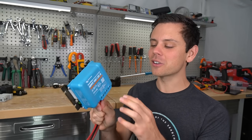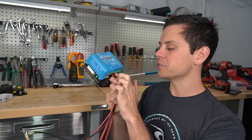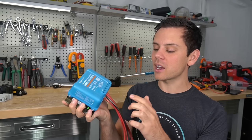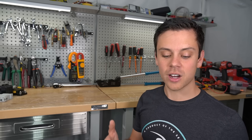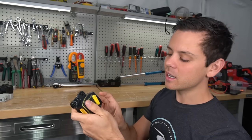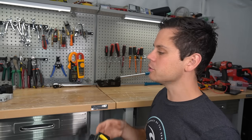This is especially important with any device that has to sense voltage from your batteries — an undersized cable will throw off the voltage readings and it will not work properly. For example, with the solar charge controller, use the largest size copper that will fit safely in that terminal and keep the cables as short as possible. For an LF inverter running inductive loads such as large motors, it is preferred to have the largest cable you can fit, so you have a cool-running cable and the voltage sensing for low voltage disconnect works properly. Try to oversize everything you can, but do not oversize to the point of causing a connection problem.